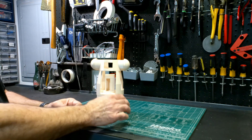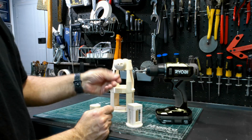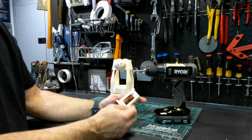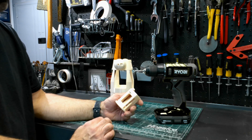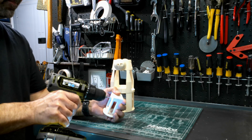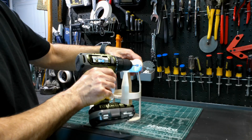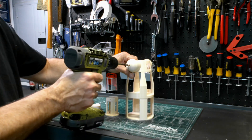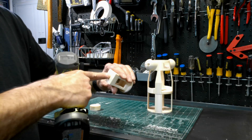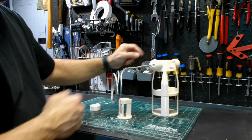All three of these parts can be found on Printables for free — link in the description. So it's a 4-40 screw, 4-40 tap. It allows the screw to thread right into the plastic. You could use a self-tapping screw and just do it that way as well — I think that would work just as well. The holes are sized for the 4-40 tap in the print. I'm simply using the tap installed in the drill to pre-tap all the holes for the 4-40 threads. There are two additional holes, one at each shoulder — this will be for the set screw to hold the arms. I switch to a quarter-inch drill bit to open the shoulder holes.